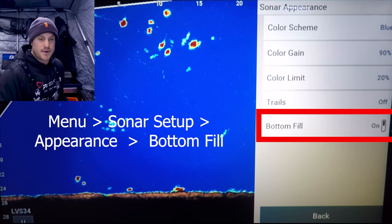Going into installation — I do like to use the HRS and I keep that on. Calibrating compass is something I've found can be very beneficial especially in the summertime, to help level where the LiveScope is facing and get it into forward mode pointed in the right direction. I don't do it a lot in winter but will do it in the open water boat because it does seem to help get a better picture and leveling. Essentially you just do a couple of loops to help the compass orient where it's supposed to be facing.